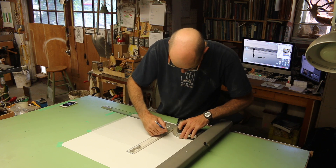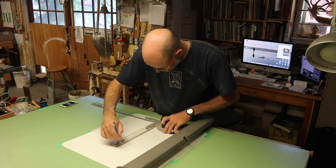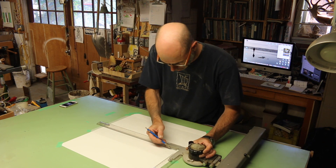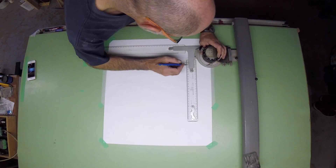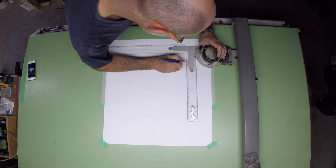What you see me doing here is creating a grid. It's the first step in producing any kind of lofting. It's really just a framework upon which you do your design or your drawing. It involves a baseline, perpendicular lines, and center lines — laid out at 12 inches, 6 inches, 3 inches.